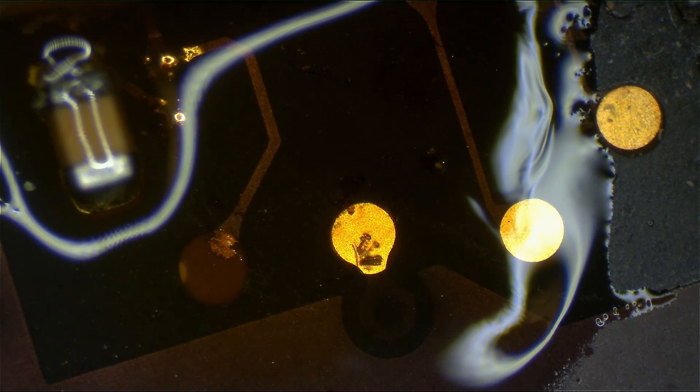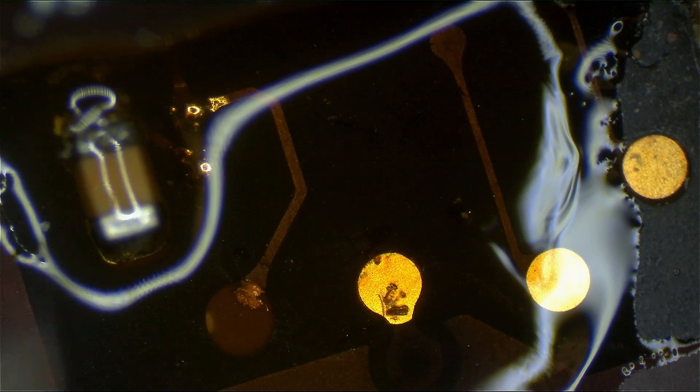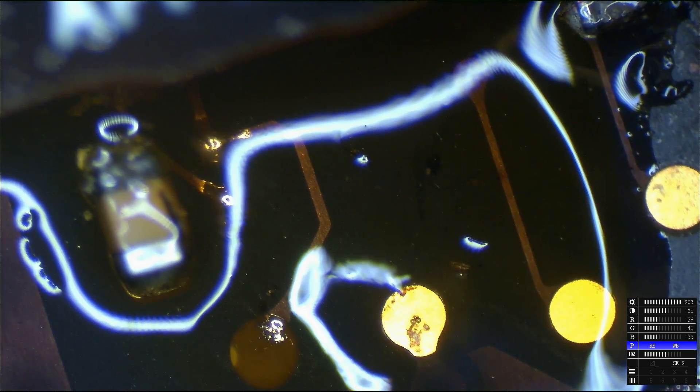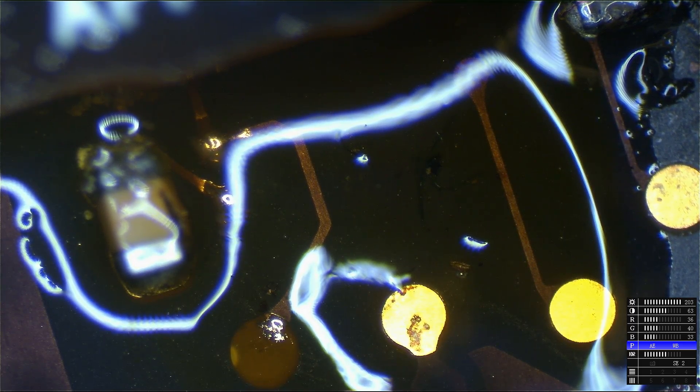I cleaned and scraped the area with my tweezers, and now I'm just going to run solder with flux there. I'm scraping to make sure I have a nice clean surface to solder to. You may ask why I'm adding so much solder — all that excess is going to stick to the elbow of my tip. The soldering tip here is a T15-JS02 from Hakko. All the excess solder won't stay on the board; it gets sucked up onto the tip. The flux cleans the board, and any dirt or junk gets pulled into that vat of solder on the tip. Once I clean the flux away, I wind up with two very clean pads.